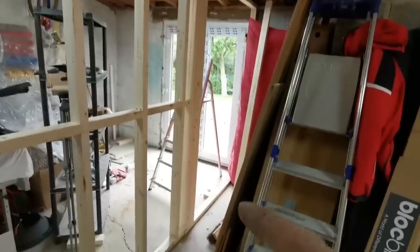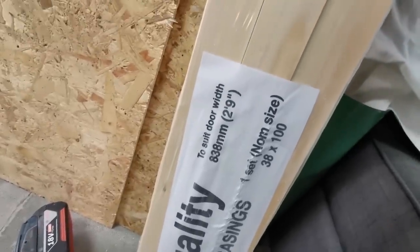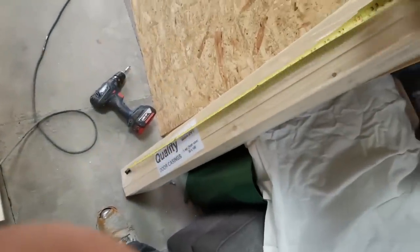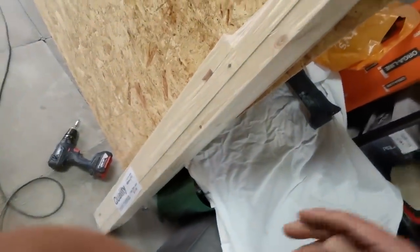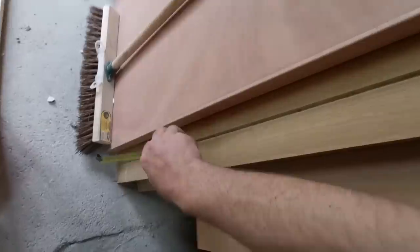Before I get carried away boarding, I've got to finish that end off — I've got to put a doorway in there. This is the casing they sell — it's for a two foot nine, 838, I think 32-inch door. You've got to notch it yourself. I can't get a 30-inch which is the size of the door I've cut, but I'll cut that first, then I can work off those sizes. It's just a cheap hollow-core plywood flush door — don't know how long it'll last but it's cheap, just for now.